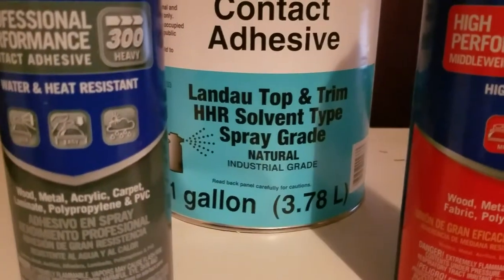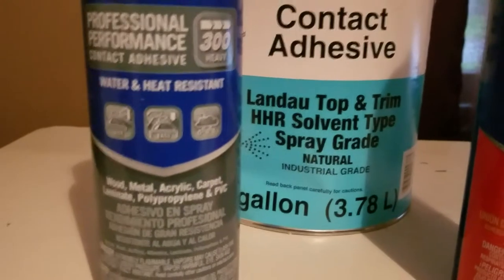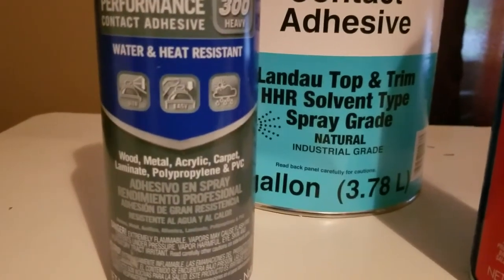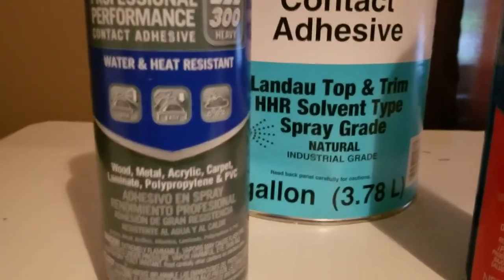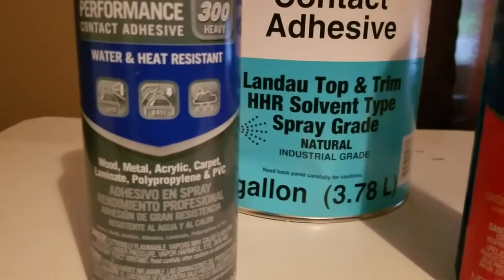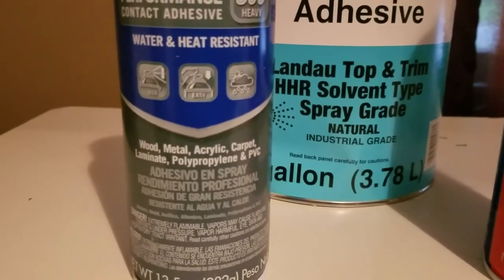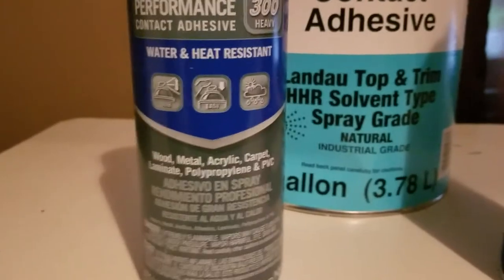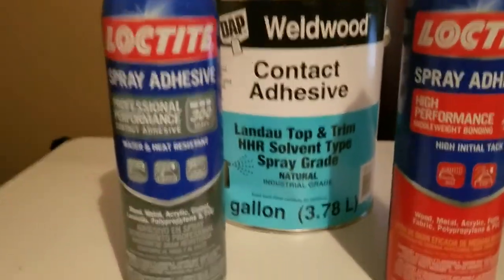But if you're not in a pinch, grab yourself a compressor. My first compressor was 21 gallons, 2.5 horsepower, and I could use it on a 110 circuit — basically a standard house circuit. That did good for everything I needed. I could spray cars with that compressor, I could use it for glue. The only thing it wasn't good for was air tools. I've since upgraded to a 29-gallon compressor — dropped to 2 horsepower — but it still manages to keep up with the pneumatic tools.